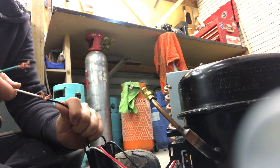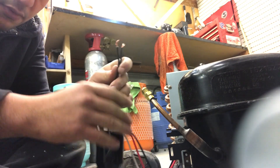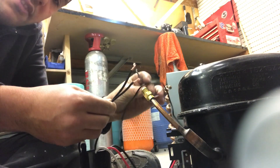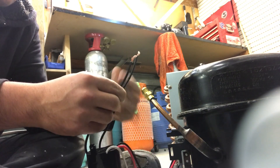And now I'm going to wire everything up properly. These two are for the power to my compressor. So now I'm going to get the two legs from my condenser fan and hook it up to these two wires here.